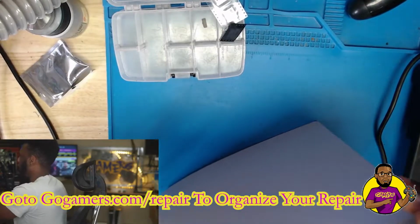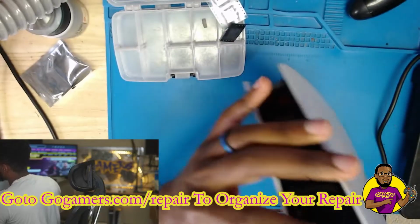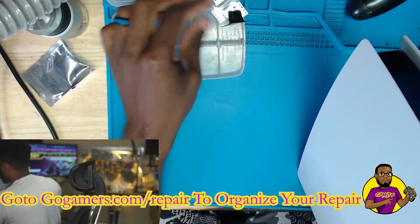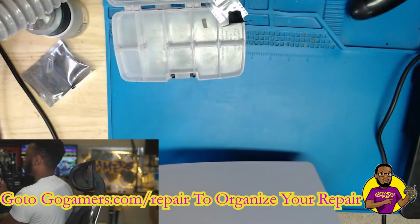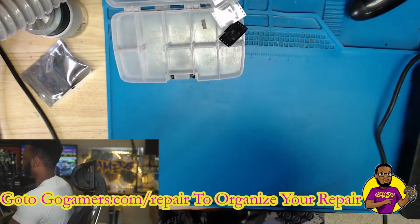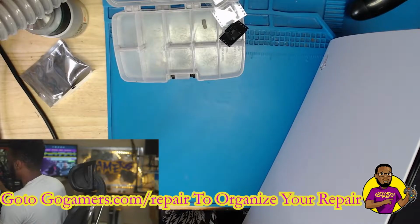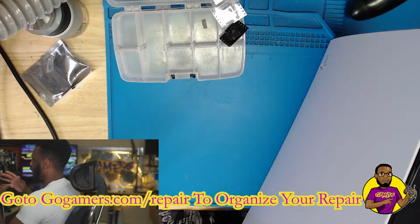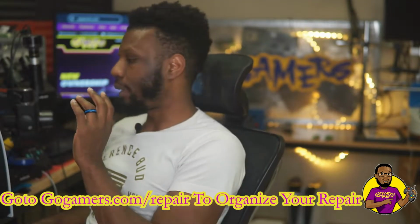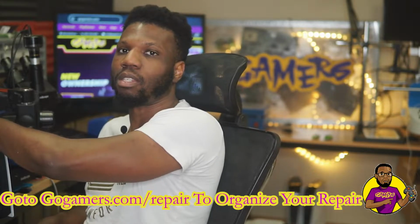Now the thing is, with this front USB port, this actually sits on the PCB board. As you guys can see, I do have that USB right here, and I have the two back port USBs over there. So this is something that we definitely can do. So what we're going to focus on first is the USB ports that sit on the motherboard. So let's get this game console down to the motherboard, and then we're going to change out those USBs, and then we're going to look at the front USB that sits on that PCB board.